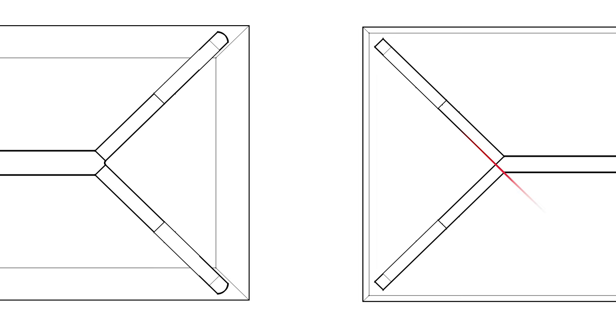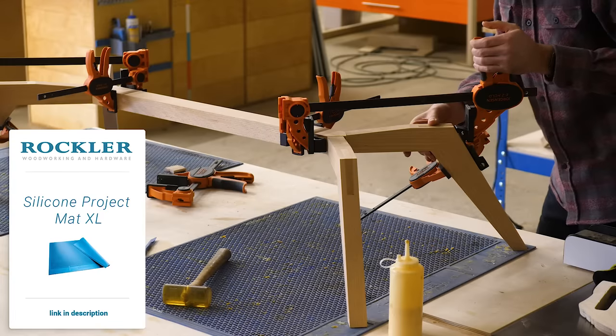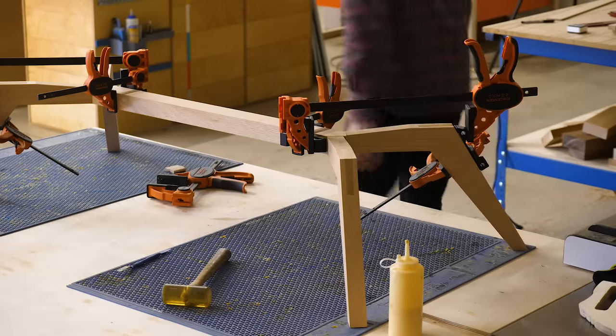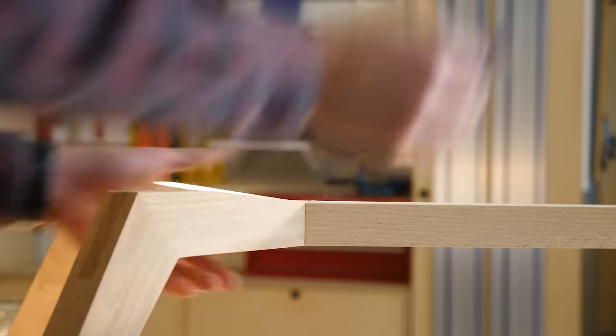But in the new design, the only necessary match is the thickness of the stretcher in relation to the end of your taper. Meanwhile, the thickness of your leg pieces and the width of your stretcher can be anything reasonably close, and we make it easy to refine everything after the fact. So it's basically the difference between trying to perfectly nail one thing versus trying to perfectly nail two things simultaneously, which, contrary to intuition, is more than twice as hard.